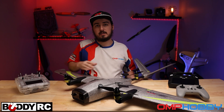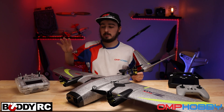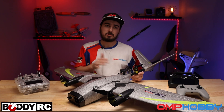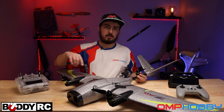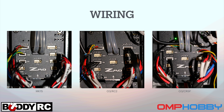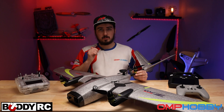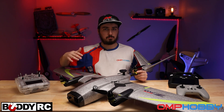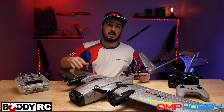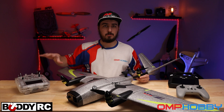This drone is set up with ELRS — kind of like Crossfire. It's a four-wire system, so you actually get your telemetry back to the radio. I've just used it almost like an S-bus device. Using S-bus is really easy. We'll have a manual showing where it goes on the board, depending on which style of radio you use. That is the biggest thing with the ZMO Pro — it is a platform. You can use DJI, Crossfire Mark 15, ELRS, Futaba, FRSky, anything that uses S-bus, or even Spektrum. This thing can go a long distance quickly, so I recommend using a long-range system. I'm using ELRS with a RadioMaster — super simple, awesome. It just works.